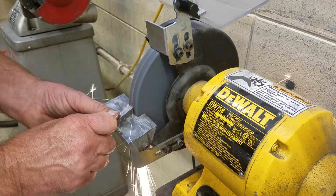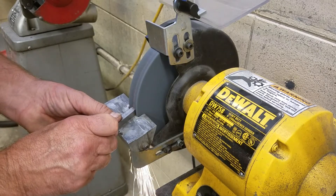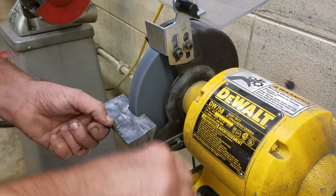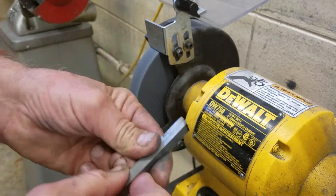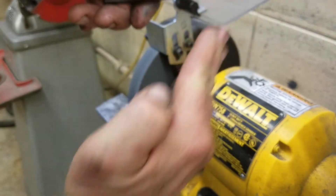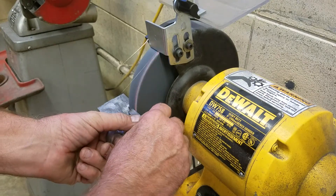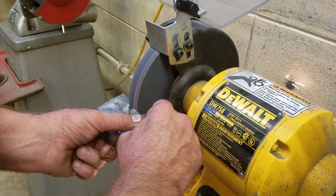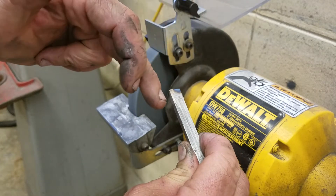We'll cut the front just a little bit more. When you dip it in the water, it's best to go water, air, water, air — dip it in and out, in and out. That way you won't heat the water up. I'm happy with the front. Now, this is my top. I just ground the front end relief angle plus I've got this clearance about 10 degrees. Now I'm going to grind this angle on the top — I'm not going to give it a back rake. I'll bring it all the way up until it reaches the top.